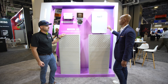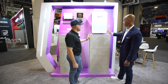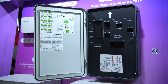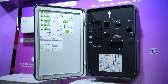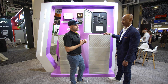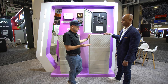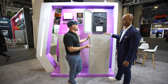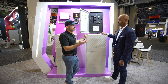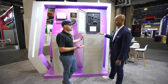If you do want the full solution with the hub, let's open it up. With the hub, you have three smart circuits up top — one double pole and two single poles that you can run up to 80 amps on. You can use those to load shed based on state of charge, so if it gets down to 50% you can kick off high loads like your pool pump or AC, just to make your battery last longer — an automatic, seamless process to reserve your battery.